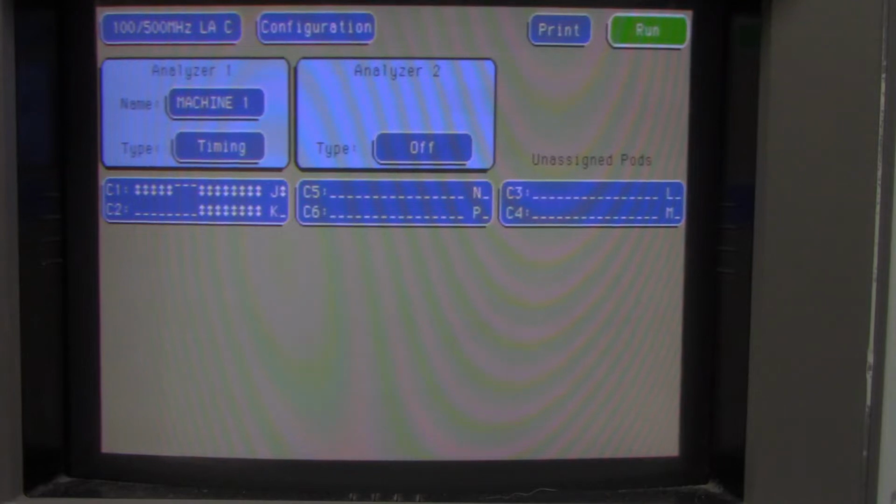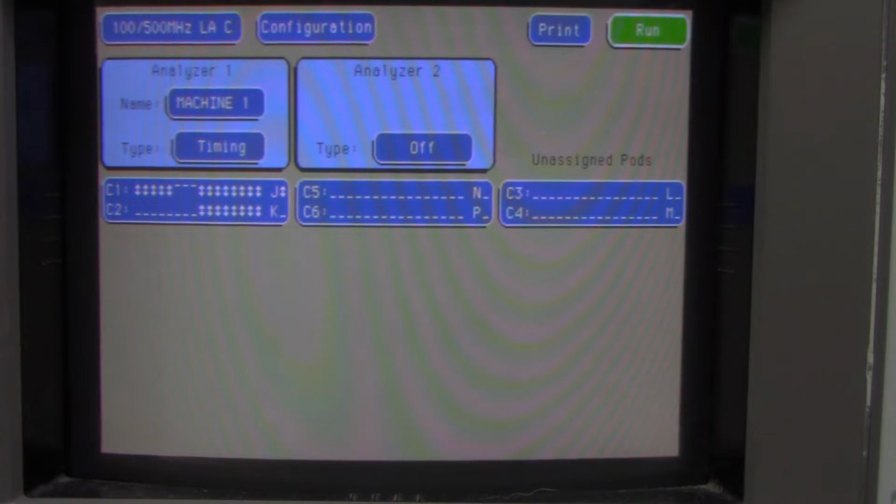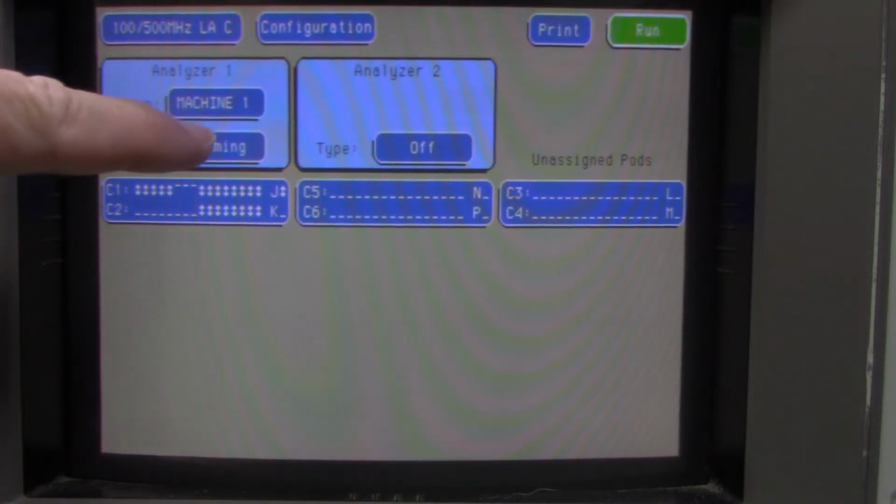So we have this J clock connected, and that's connected to what's called PSEN on the 8031, which is the program strobe enable. Whenever you read the program memory, it puts out a signal so it knows what to latch on. You need to have one clock. So we're going to do the state analysis.